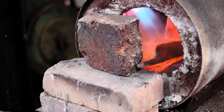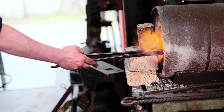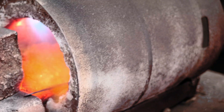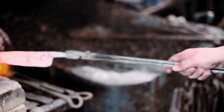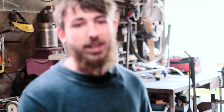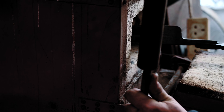I like to run the forge as low as possible for annealing, and I'll make sure to turn it over so the heat isn't all coming from one side, as that could give it some uneven stress. I'm shooting for about 860 degrees. I'm going to test whether it sticks to a magnet, then go roughly 100 degrees above the temperature at which it stops sticking. It's a very rough way of telling temperature — I wouldn't advise it for anything that scientifically matters. Like I said, it's a mechanical step that gets it easy enough to cut. If I was doing an integral knife or a big stock removal project, I'd put it in the oven and anneal it at the exact temperature to get it as soft as possible. But for this I really only need to do 20 minutes of grinding, so it's not an issue if it's a little bit harder.